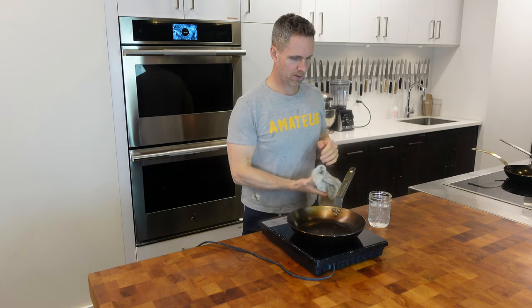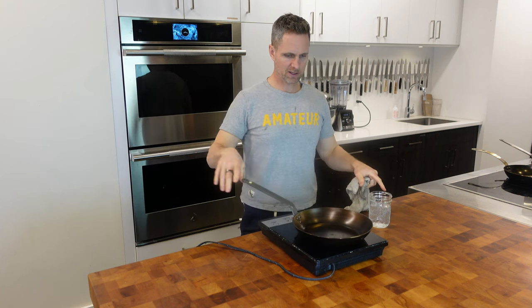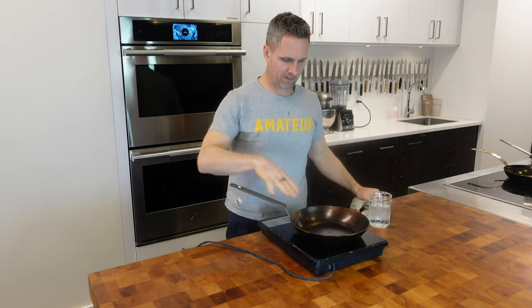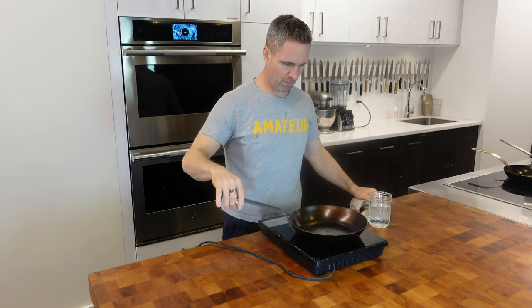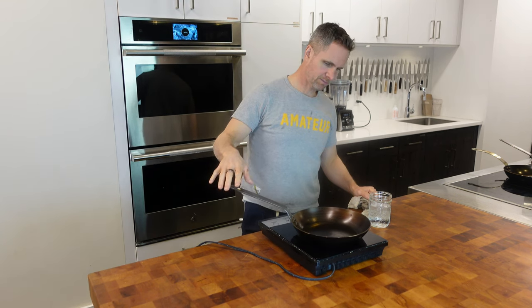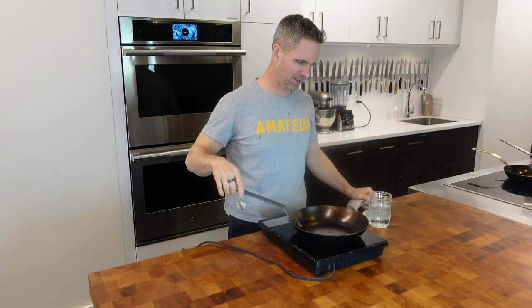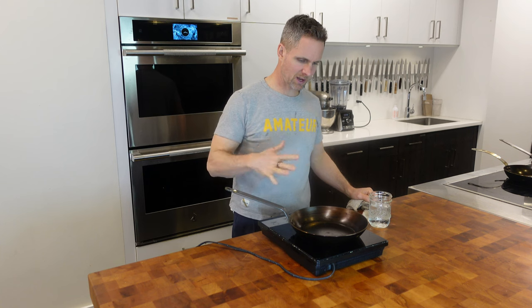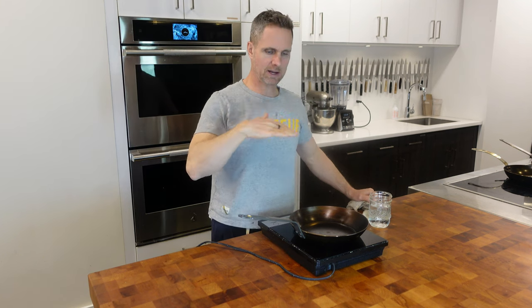Okay, so I've warmed this guy up pretty intensively. It's not really spinning on here. I'm going to turn him up just a little bit more, see what I get from it. But that hasn't warped anything. It's moving a little bit on there, but not really in a warp style. When you have a warped pan and you hit the handle, it should just spin.